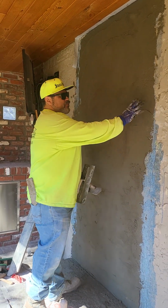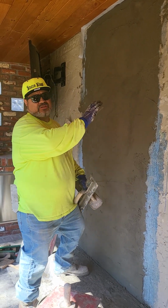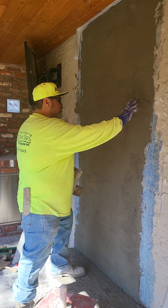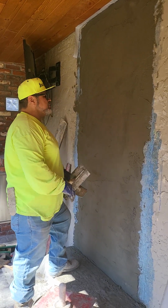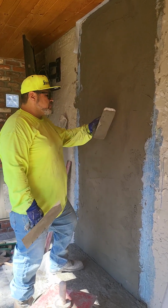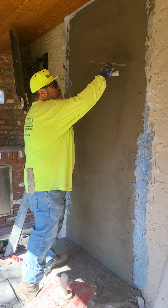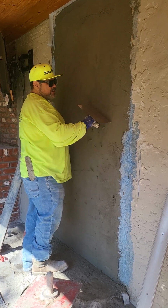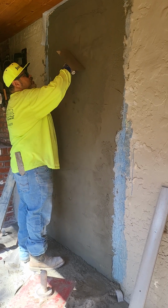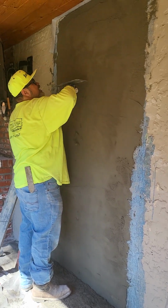The outside of the perimeter of this stucco patch is still wet because it has a different suction, a different bond to it. Because of the glue, it's drying slower, but the middle of this is drying a lot faster. I just wanted to show you what we do. I put this mud on a little bit proud on purpose, and for that reason I'm just gonna come back and shave it down to where it looks kind of flush. When I do that, I'm just leveling it out.